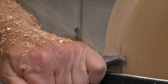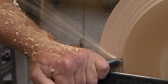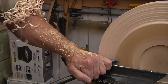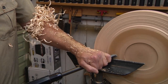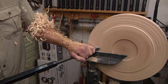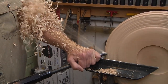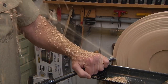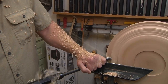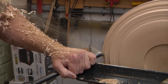This makes some really cool shavings. I love turning ambrosia maple because it's a really nice wood to work with. You can feel or hear the jiggle — that's because the bottom is not completely flat. The only place I'm really worried about is right here because this is where it's going to rest on the table, so the rest of this wood is going to go away. I'm going to keep pushing this out to get closer to the OG shape.